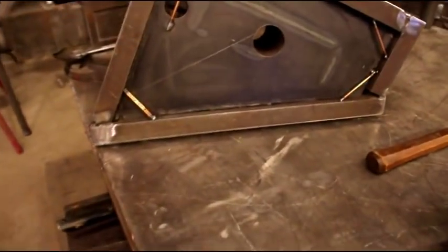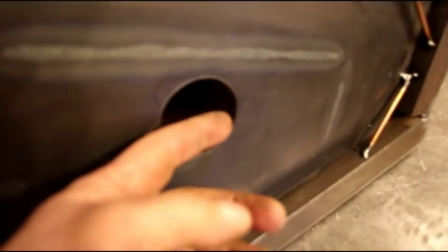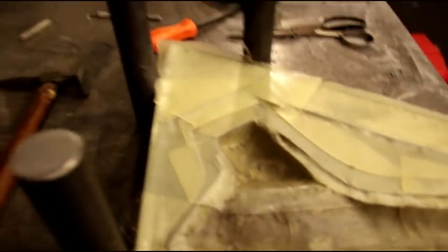And I had to make sure I got this flange tucked in there real tight all the way around, and I think I got that pretty good. Now here is our top piece. I got this cleaned up and the material is going to flow in here. I've got a 3/4 lip here, plus the material is going to flow down and there'll be like a tongue on that which will match this.